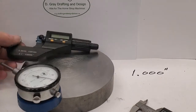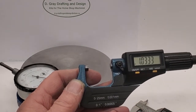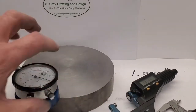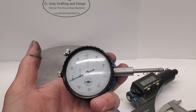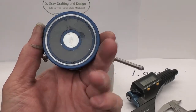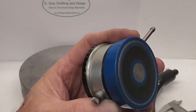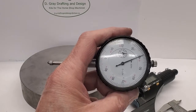Here's a digital micrometer - manual or digital, we'll need a micrometer to get an exact measurement once we clean up these faces. We'll also need a dial indicator. You can use an arm-mounted one with a magnetic base, or this one has a really handy accessory - a magnetic back. Your dial indicator just screws onto this adapter and you can put it directly on the ways of the lathe to do very exact movement of the carriage.